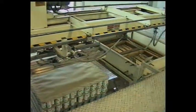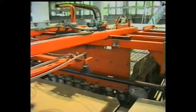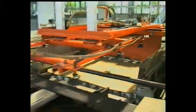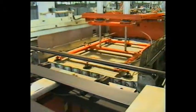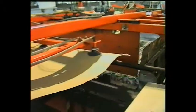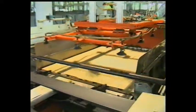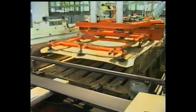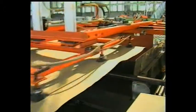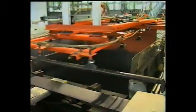The 2,000 cans per minute carbonated drink line is the fastest in the world. The Weyerd BDA 3200 model can depalletizer unloads the empty cans from the pallets. This system has been engineered to perform at top efficiency with an absolute minimum frequency of error. The empty cans are conveyed to the Unipack Rinser by Fleetwood Air Conveyor Systems, where the cans are being rinsed with hot water.